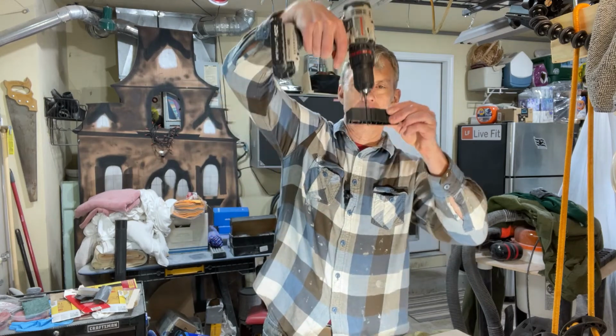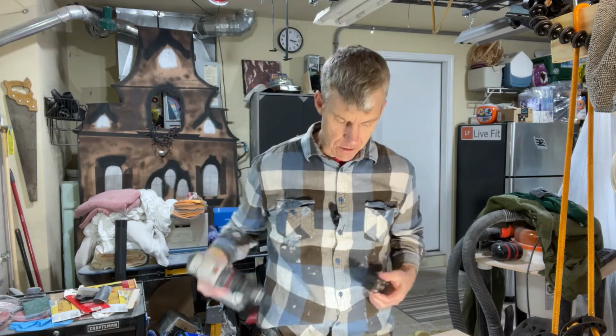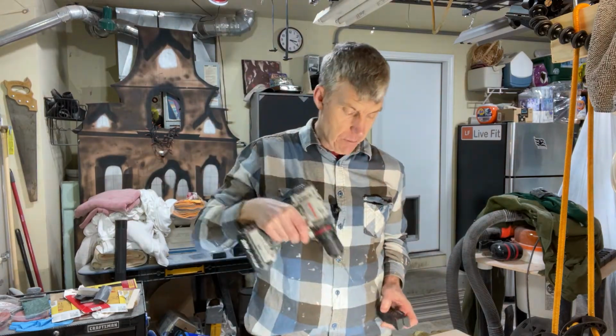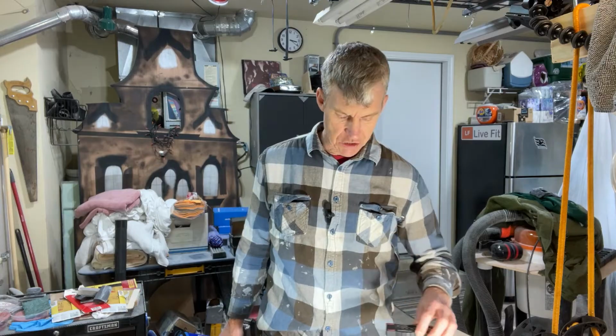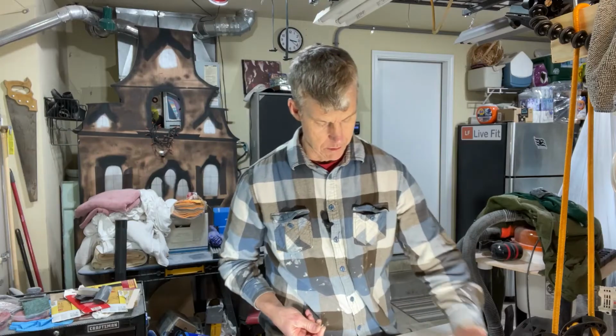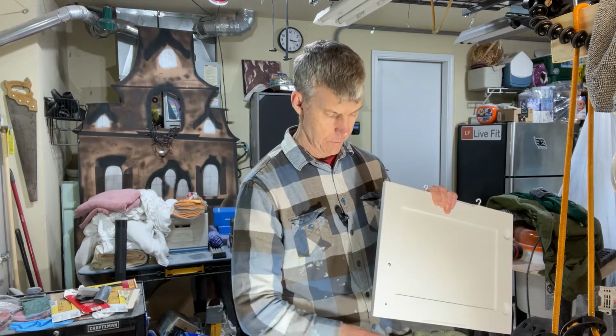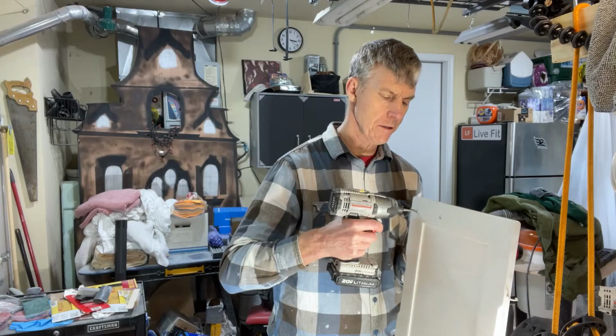And I have this drill block I use so I cannot get crooked. It's really easy to have the drill at a slight angle, and when you go to screw it in, it looks straight, but then when you have something like this, you'll really notice if the angle is not perfectly straight. Stick my screws through. All I need to do now is put the handle up against the screws, holes, and in they go.